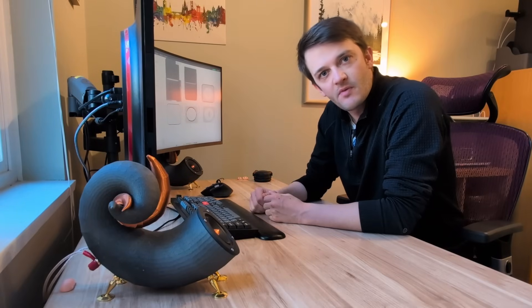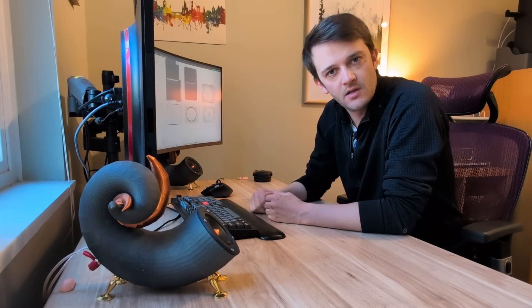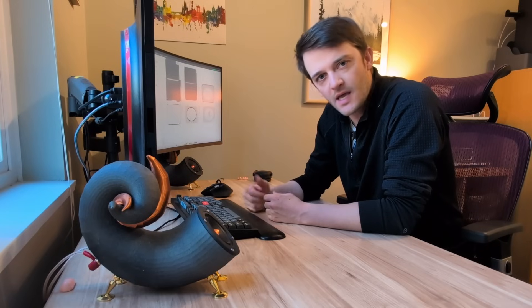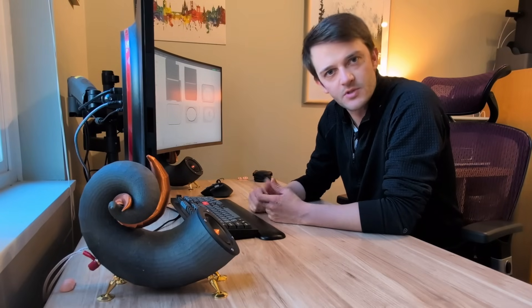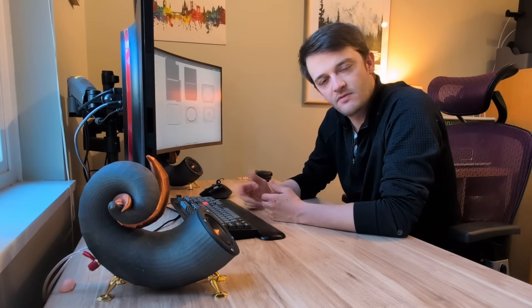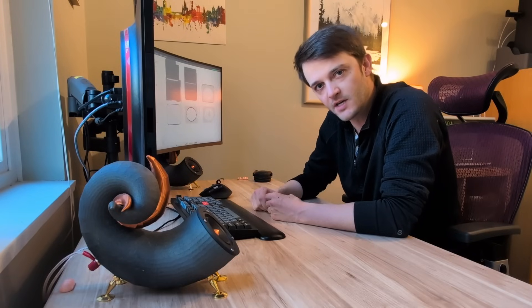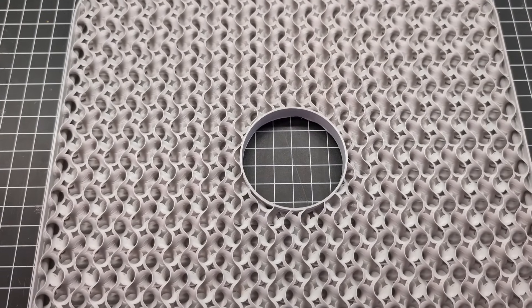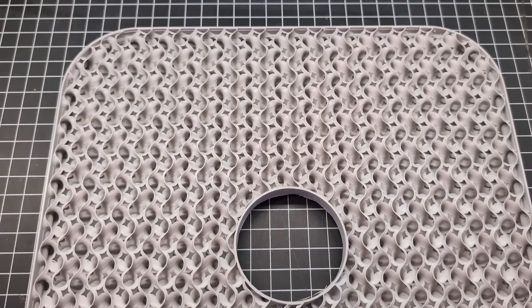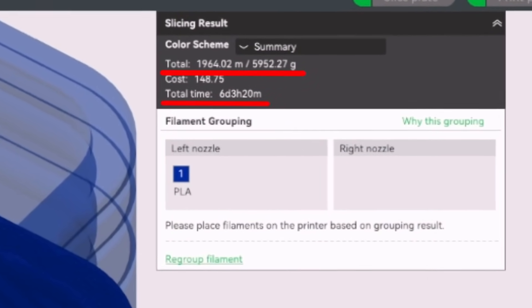The objective of this build was to provide more bass for the existing desk speakers. I was aiming for a sealed enclosure that could reproduce that tight accurate bass that's great for music, which is primarily what I listen to at my desk. The inherent challenge lies in the fact that sealed subwoofers need to have a decent internal volume, be airtight and have exceptionally rigid walls to perform adequately. While 3D printing excels at creating complex three-dimensional geometry, achieving airtight structurally rigid prints usually involves consuming frankly excessive amounts of filament and time.